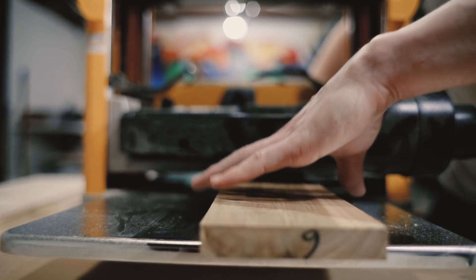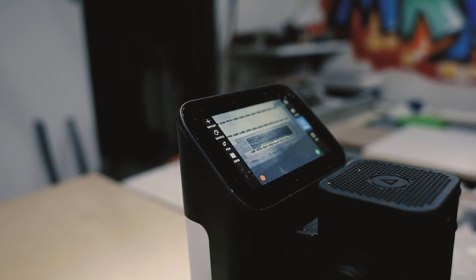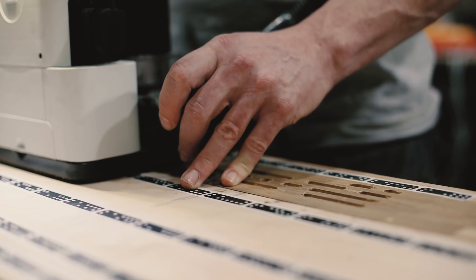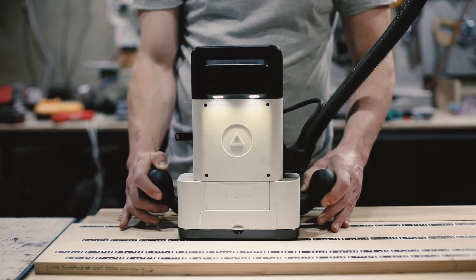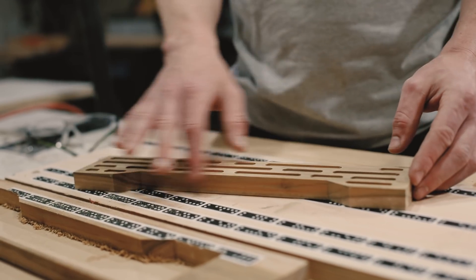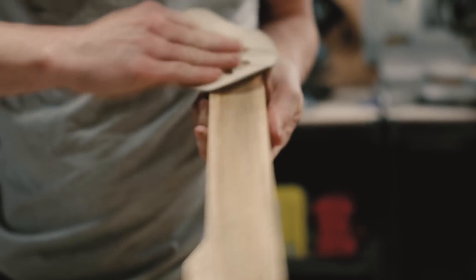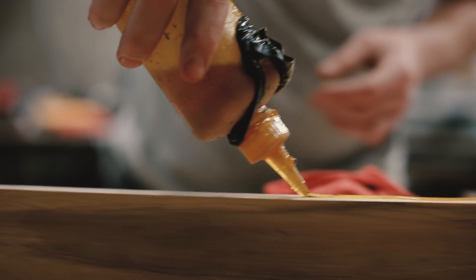This design was a really quick one to come up with. I just went into Fusion 360 last night and spent probably about an hour designing this little pattern, brought it down here this morning, dropped the file on the Shaper Origin thumb drive and cut it out. This is solid three-quarter inch teak and it went through it really easily — the edges are just flawless. I just hand-sanded this with 220 grit quickly and it came away with no fluff, and that's with an up-cut bit too. Really happy how that came out.